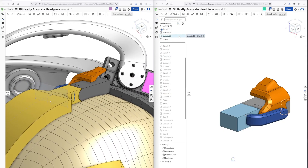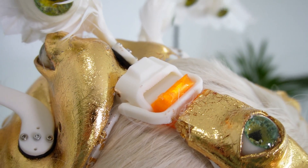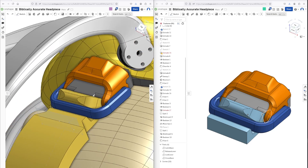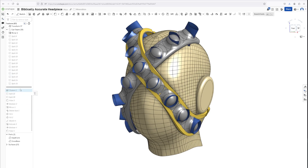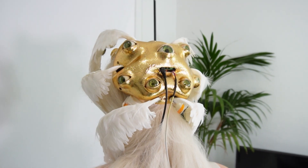I would say that I'm still figuring out my workflow when it comes to design — I think it's something you never truly perfect. In this project I tried using Onshape's derive function to create a subcomponent in one part studio, and then use that in a larger design in the overall assembly. This ended up working really well because I was able to design the snap-locking latch by going through a few design iterations, and it was pretty seamless to see any changes reflected in the overall assembly. I'm really happy with this design because it's fully print-in-place without fasteners and holds a pretty good amount of weight. Using the latch mechanism as a starting point I was able to block out the base cross, then by converting it to surfaces I could make the whole thing smoother, add intersecting surfaces for the eyelids, and boolean it all together with some thickness, giving a very organic looking part that was fully parametrically designed. As for the plate on the back, which covered all of the servos and electronics while also leaving movement space for the wings, that part was less simple.